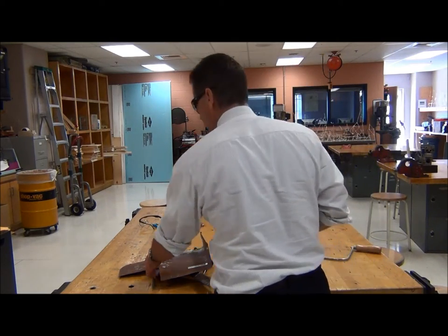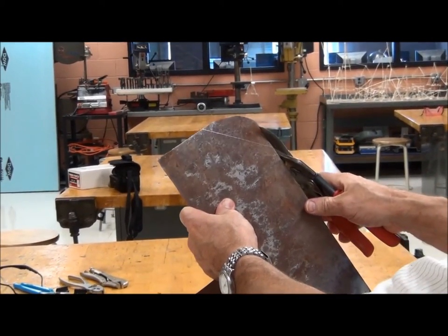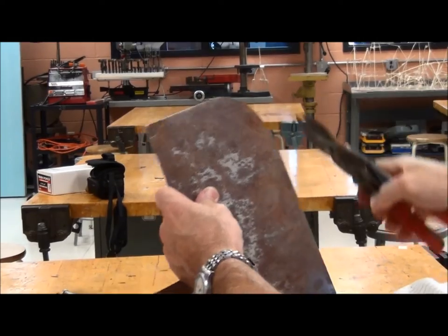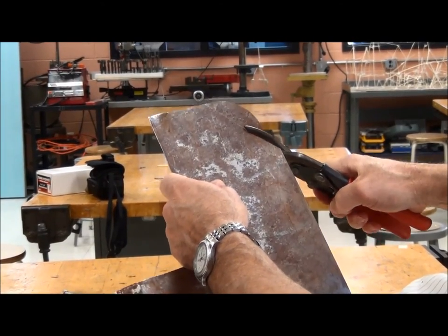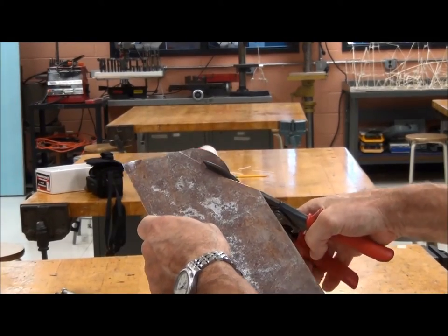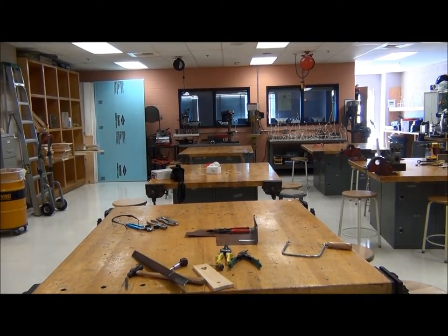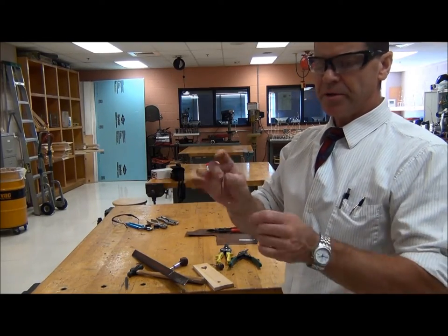So let's cut this piece of metal. First, I'm going to show we can cut a curve here. I've got this piece of metal — it kind of cuts in here. I'm taking little nibbling cuts a little bit at a time. You can see the piece of metal coming off there and snipping right off. I was able to cut that curve. I can also cut straight on this line, a little bit at a time. I am exerting a bit of force with my hands to make this cut. These snips are able to cut the sheet metal. Of course, with sheet metal, you make some really nice sharp edges — you want to be careful with that. This could give you a nasty little cut, so let's be careful.